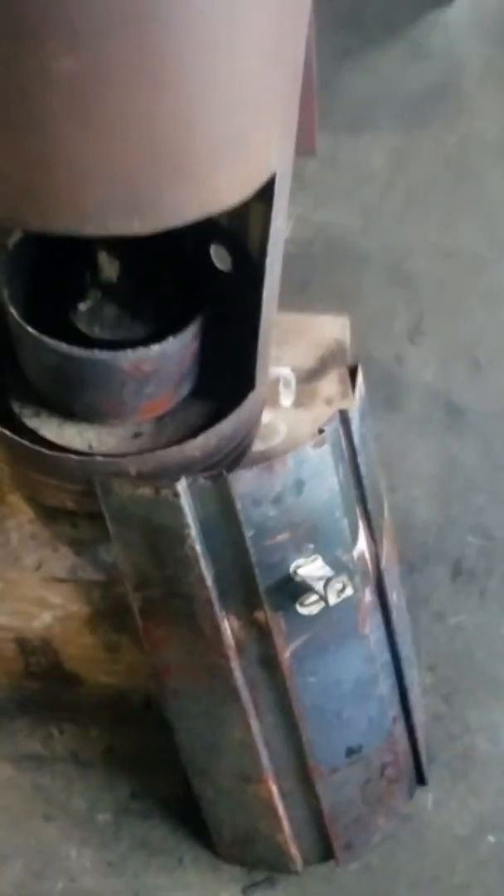On this one I came out the side, which I think I like better — that way I can keep the drip 90 down lower and I'm not pushing everything higher. The tank is full and sitting on a base. I left two holes in there because they didn't really hurt anything — they were cut in when I was blowing wood. Here's your baffle plate, which I find tweaks it and gets it burning a hundred percent.